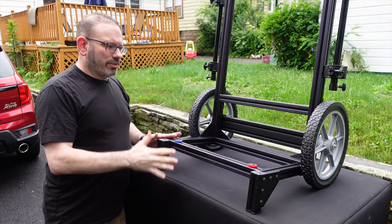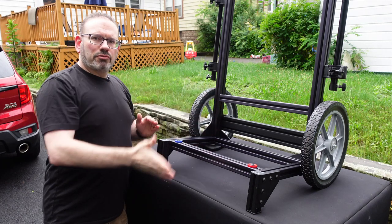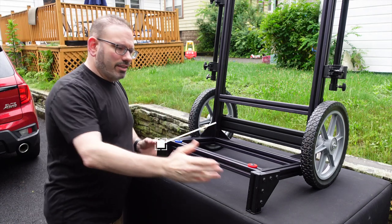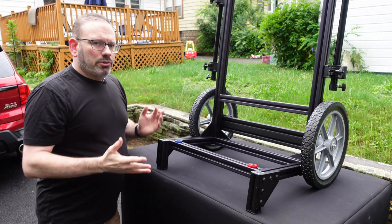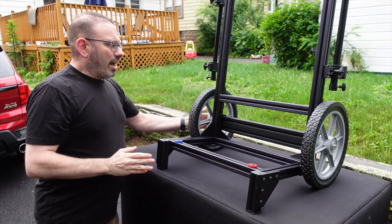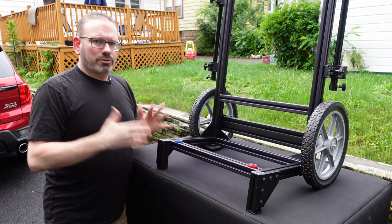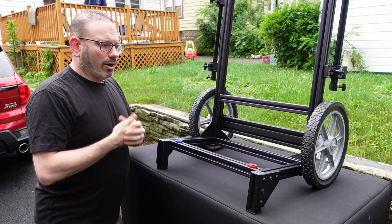One of the first things you may notice is it sits on a slight angle, and I wanted that — at least a couple degrees to work and operate if necessary. I didn't want just a straight 90 degrees, so I made these legs just a hair taller. The beauty of this is I can replace these feet and adjust the height of where the back wheels go. That's the beautiful thing with 80/20 — think of it as Legos for adults. I can reconfigure this at a whim.